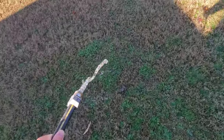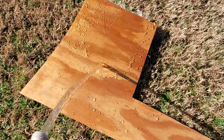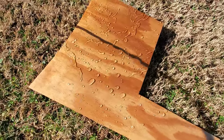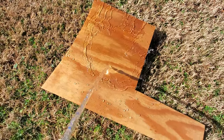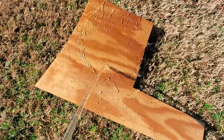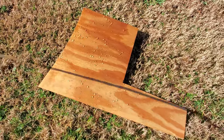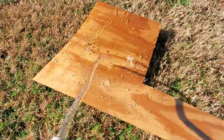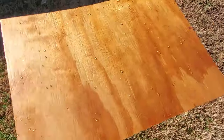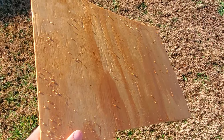I want to show you guys this real quick — this is the idea behind that cured resin. As you can see, the water just beads right off that resin. I've done videos on my channel showing parts like this submerged in water overnight with no delamination of the plywood. So this is perfect for a boat part with carpet to give it an extra layer of protection in case you get caught out in a rainstorm. I still recommend the boat stay covered or in a garage, but this will help with long-term wear and tear and give this part the ultimate lifespan. Now I'm going to go ahead and sand some of the sheen off with 60-grit — knock that sheen down and give the carpet glue something to bite to, because this cured resin is a really waxy surface.